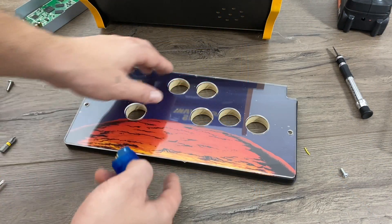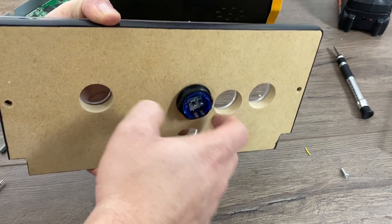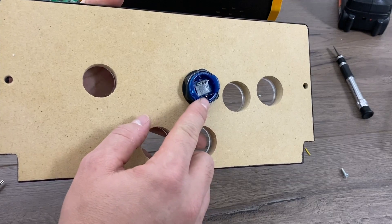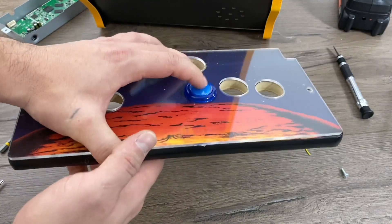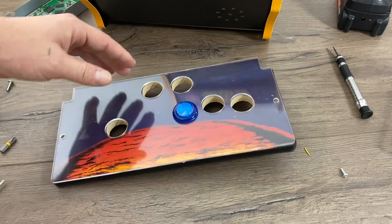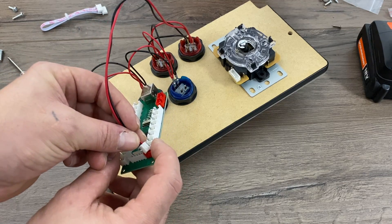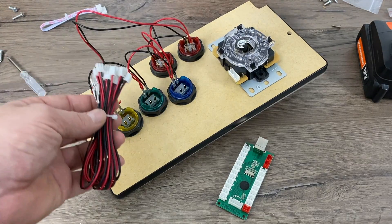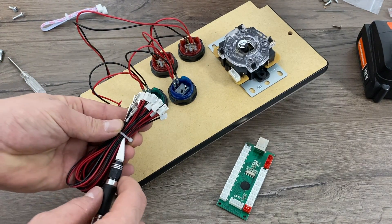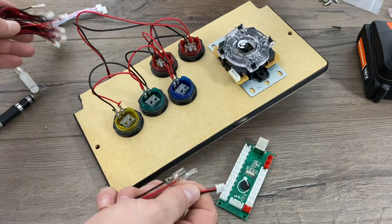I'm using this cheaper set of buttons — these are LED backlit. They fit right in the new control panel from Tulsa Arcades. If you are using these LED buttons, there are two connections for the LED: positive and negative, and then two connections for the button itself. The connection for the button itself is not polarity sensitive, but the LED is. I've placed my buttons in the control panel and hooked up my LEDs. Keep in mind the LED connections are polarity sensitive — positive goes to positive, negative goes to negative. As for the button connection, it is not polarity sensitive, so you can put these on any way you'd like. You just need to plug them into your encoder board in the correct locations.